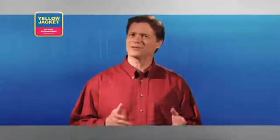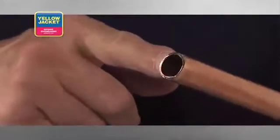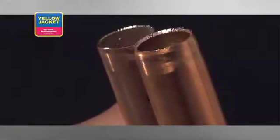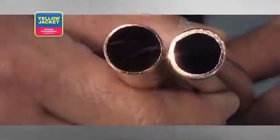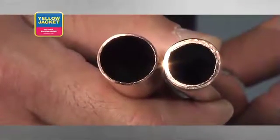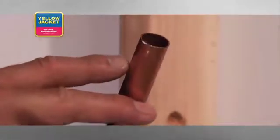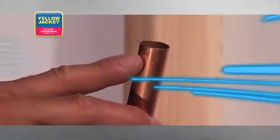Let's take a look at what over-tightening the tool's grip really does to the tube. Here is a perfect cut, and here's a cut from a tool that has been over-tightened. Notice the thickness of the tube's wall at the point of the cut — this cut has rounded off the end of the tube and the wall thickness has been compromised and may crack when you flare or swage that end. In contrast, the tube with the perfect cut has its entire wall thickness intact at the cut end.